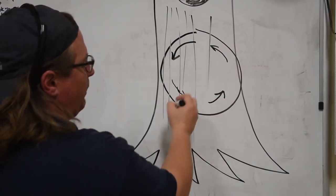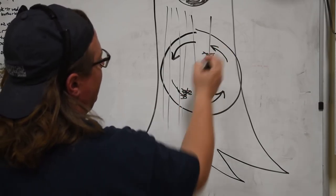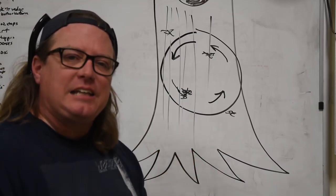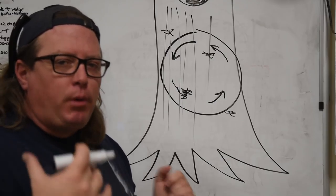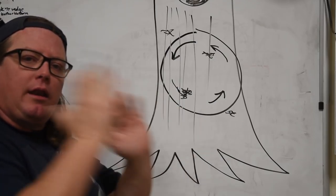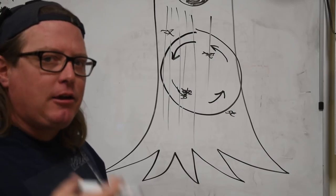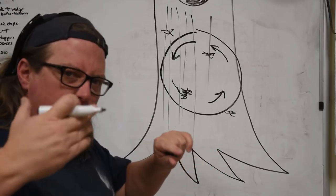So at two different spots on most bowls, on the interior, it's right here and right here. On the exterior, it's right there and right there. You have to cut against the grain. And that's why we have tools unique to bowl turning. It's also why we like to go into the bowl and not just cut it straight round flat like a plate, because it allows us to manipulate the grain a little bit so we're not hitting that end grain face on.